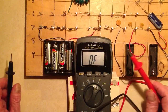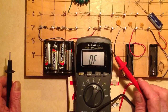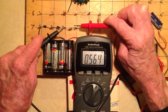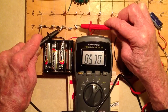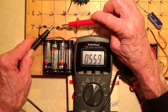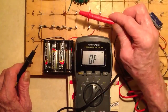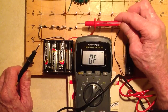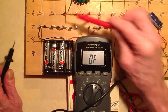There are other types of diodes — Zener diodes and things like that — that are in fact meant to conduct in the reverse direction. We call this forward bias when we make the cathode of a diode negative with respect to the anode. The internal voltage of this meter measures about 0.568 volts for one diode, 0.559 for another, and 0.566 for the third. These are the forward breakover voltages of the diodes.